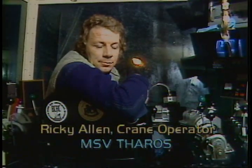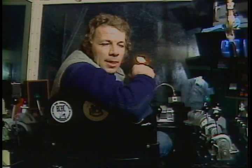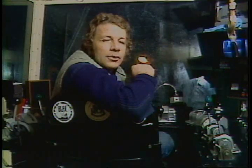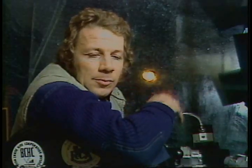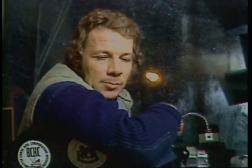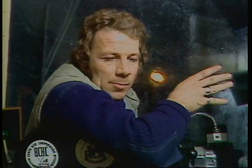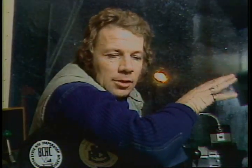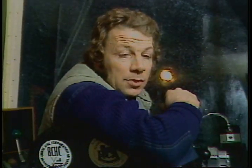When you're offloading a boat, hook on and make sure the crew are out of the way. Usually the crew doesn't give you signals — it's left entirely up to you. If you've got four bridles going to a container and your two further slings tighten up first, you're boomed too far up — get your boom down. Vice versa, if the two slings nearest you tighten up first, you're boomed down too far — square yourself up. Get ready to take your lift. Wait for the boat to come up on the highest part of the wave, take the pick, clear the boat, swing off the boat, and then start coming up to the rig. When going back down to the boat with a lift, stay away to the side of the boat until you're just above deck level, then come across the gunnel and place your lift. But always watch out for the crew — they have bad habits of going in between lifts and you can't always see them. Don't pick until you are ready.